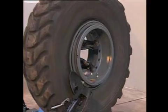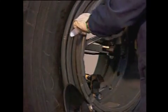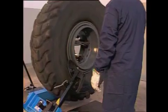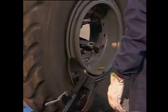Tool push will gradually release the first fastening bead wire, to be then removed by means of the short lever delivered with the machine. A further push will also release both the seal and the second fastening ring, to be then removed by hand.